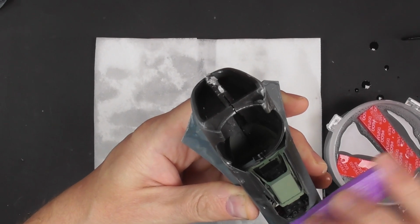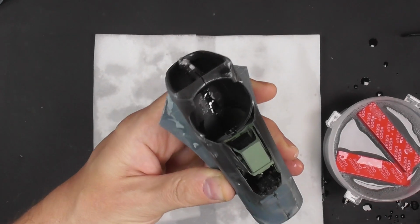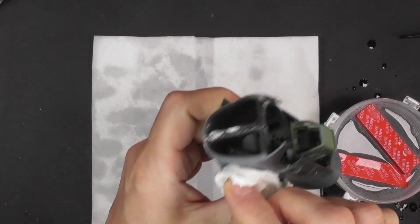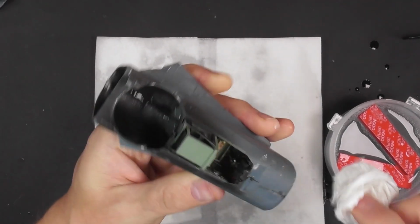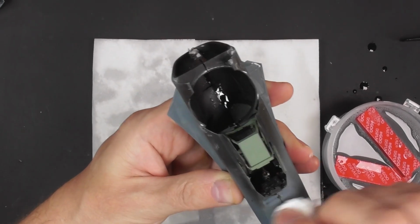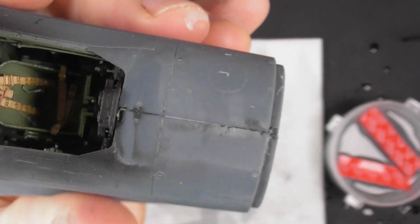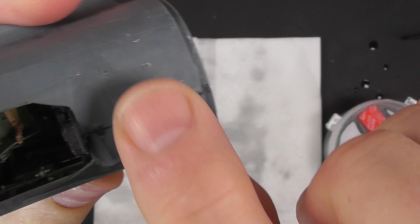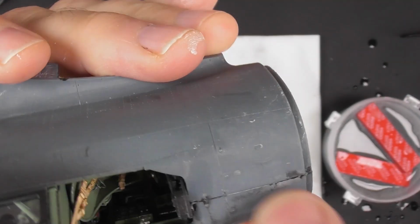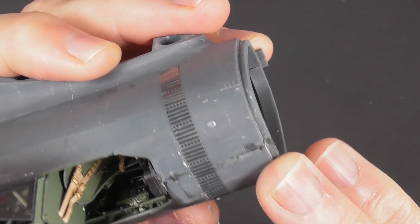And then using these sanding sponges, which do curve a little bit, just to help sort out the sanding of the joints. Wet sanding. That will reduce the dust, very important. Obviously, resin dust can be nasty stuff. So if you sand it wet, you're going to get gunge rather than dust floating about. And that seam line there at the front, at the top, is perfect.